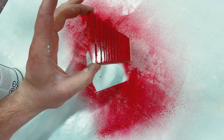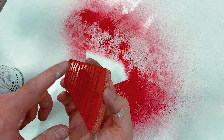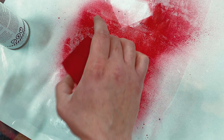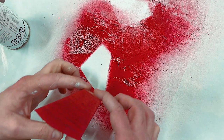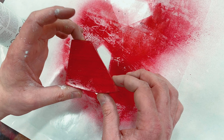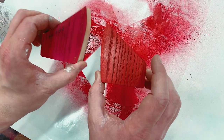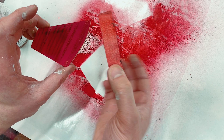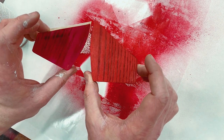Here's one I'm really excited about — this is the Heritage Red from Oxford, and that is an awesome color. It dries a little darker; you'll see it's got a bit more of an orangey hue to it because it is Heritage Red. Dries in a few seconds — you can see I'm already touching it, and that was over the dark grain filler that was sanded back. Here we're going over the clear grain filler about 30 seconds after spraying the last one. Doing my quick two passes, and you can see how those two look. Over the dark grain filler — nice little accenting technique. You could also do that over the dye sand-back. On the plain grain filler, comparing to the Unicorn Spit, you can see the change in color: one's a little more vibrant pinky red, and the other has a more orangey, vintage heritage red look, as you'd anticipate from the name.